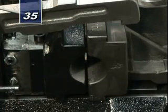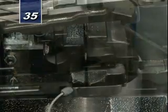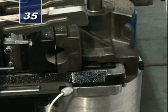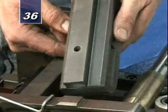Step 35: Move clamp die cylinder. Check to ensure face of clamp die and former are parallel. Adjust with socket set screw on rear of former if necessary. Lock jam nut.